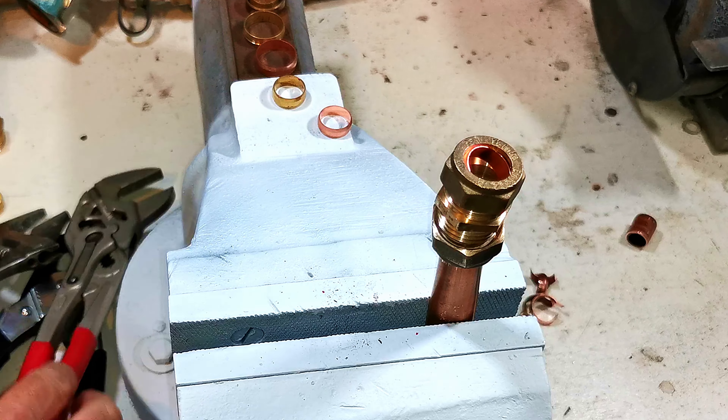With a little messing around I managed to get it apart. The thing about brass olives is they are really strong and much harder, so when I try to cut through it, you can't cut through it - or maybe you can if you've got super strong hands, but I can't. What I do is use the cutters and cut into the olive as much as I can to score it, then remove the cutters and put them back on lower - maybe a quarter of the way down or a little bit less - and cut again. The cutter will cut through that quarter of the olive and then the rest will just break, because brass is very brittle. You can see it's now cut through - it's only cut through half the olive but that doesn't matter as long as it comes off the pipe.